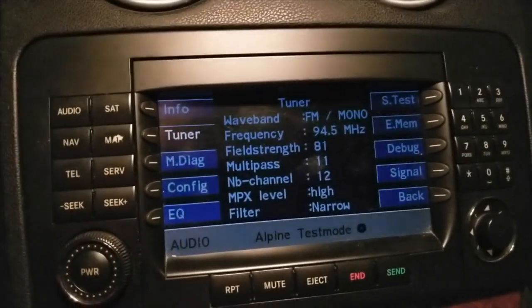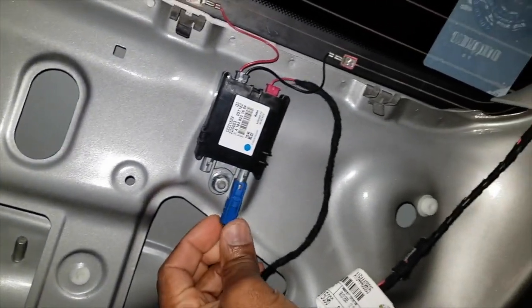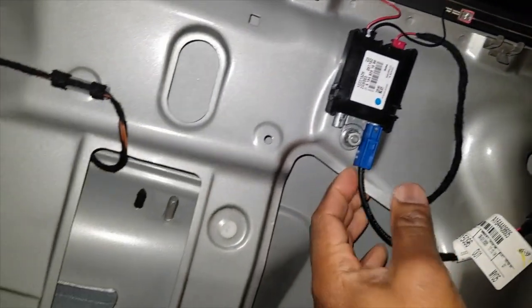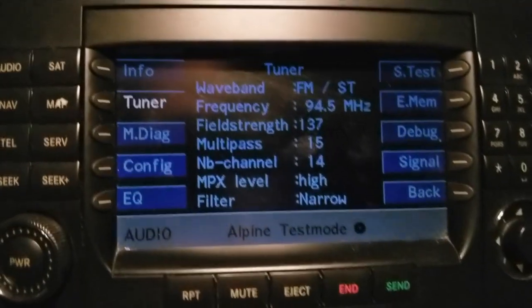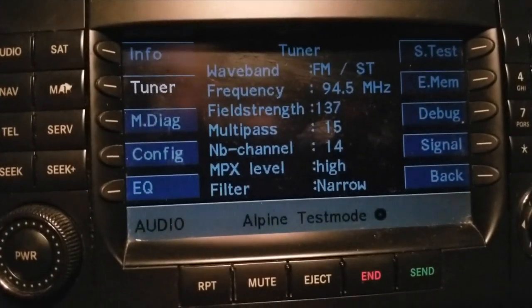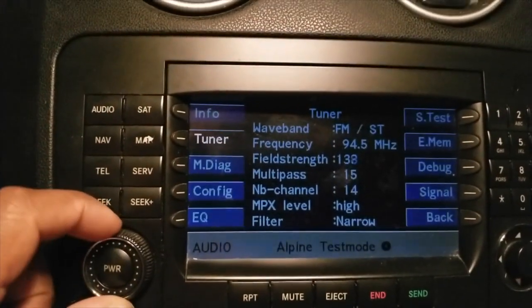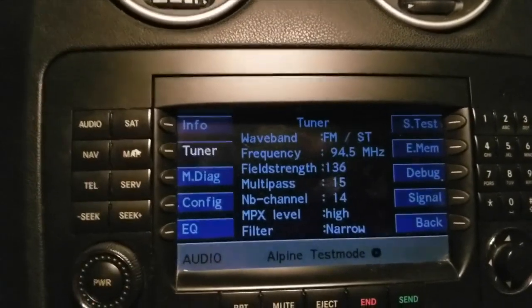So that's how you tell. I'm going to reconnect the antenna and we're going to see how it jumps back up. So I'm going to reconnect it. Okay, so it is now reconnected. Field strength is back up to 136, 137. Let's listen to what it sounds like. Okay, no static. Clean signal.